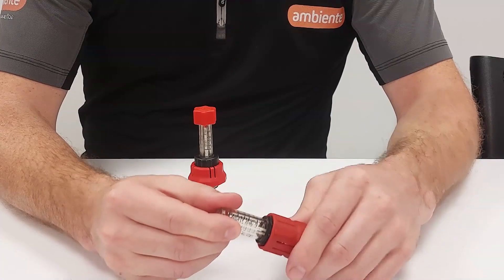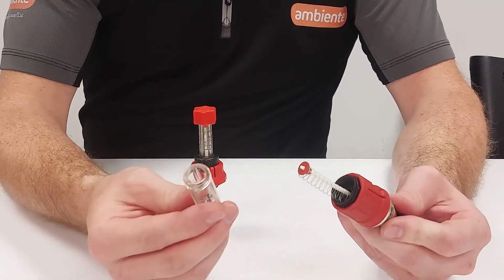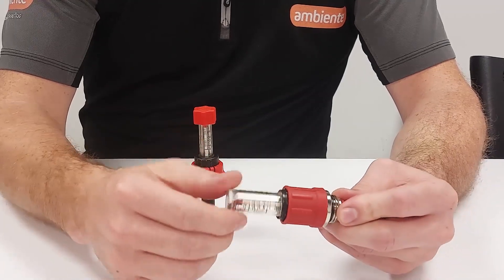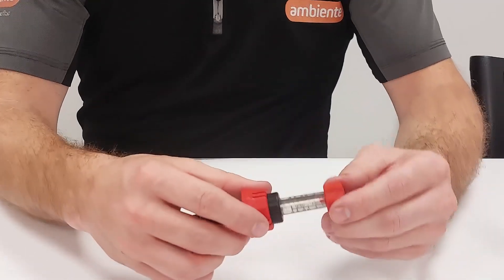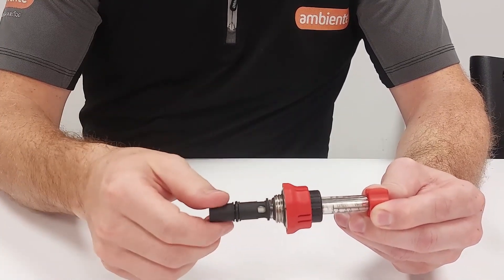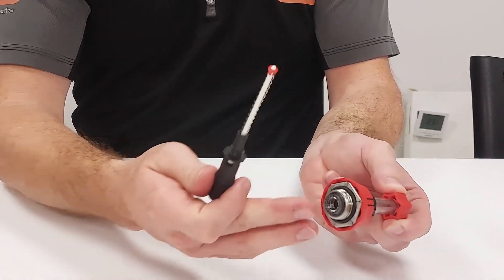In phase three, we cover cleaning and replacement parts. The top three things to look at start with the flow meter. In front of me is a previous version and this is the current version. I want to show you how to remove the sight glass to clean it — these are the first things that get dirty and orange with gunge. On the current model, the sight glass goes further down the valve and has a reverse thread, so note that as you remove it to access and clean the sight glass.